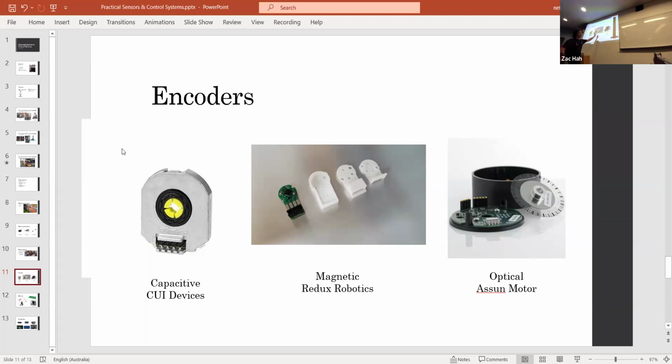Yeah, magnetic encoders are absolute. They can also be relative. Optical encoders, they can be either as well. You can get absolute ones, you can get relative ones. Because it depends on a physical disk, you'll also see that sometimes optical encoders are a little bit more bulky, but also they're generally more for industrial applications where the accuracy is really, really good, but the precision is not that high.